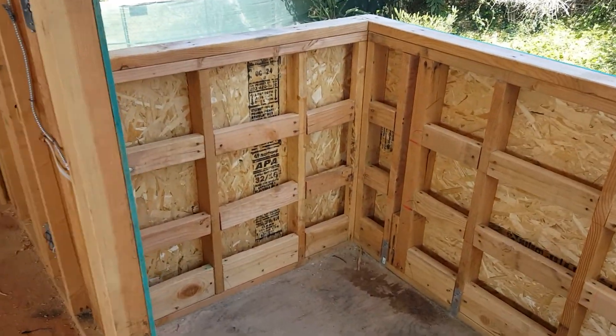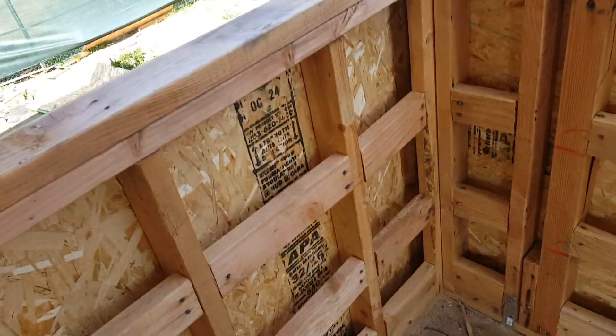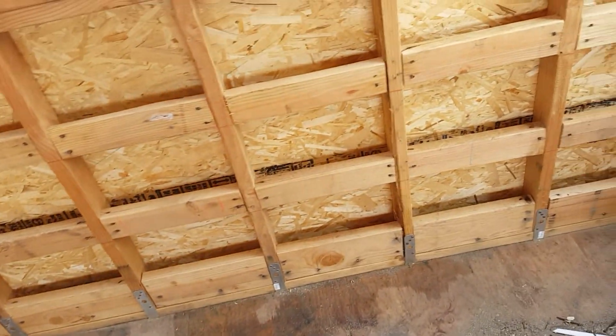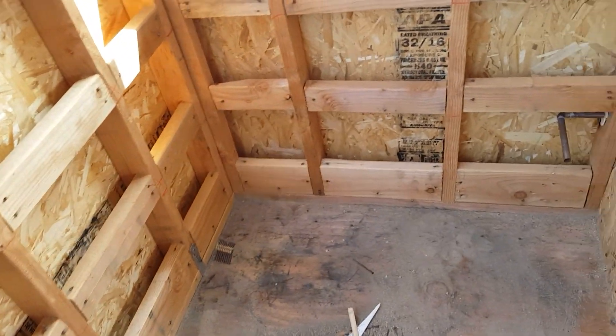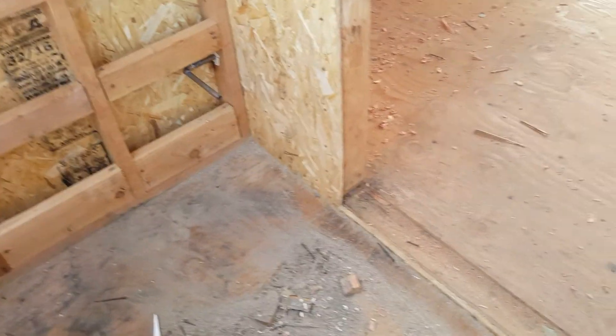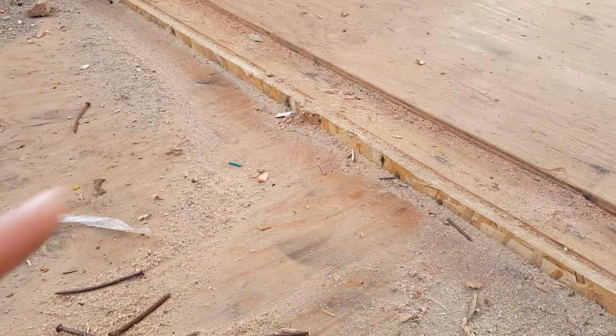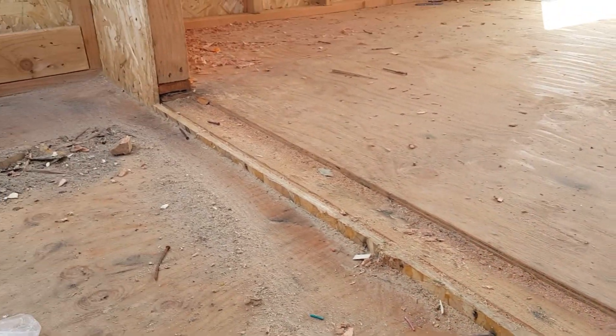Here is the deck — we just want to start doing our waterproofing, so here's the top of the deck. We actually got it inspected today by the city inspector. You can see how we cut the beams below, like we said, two inches, and we got our slope from our beams. You can see where the transition is.